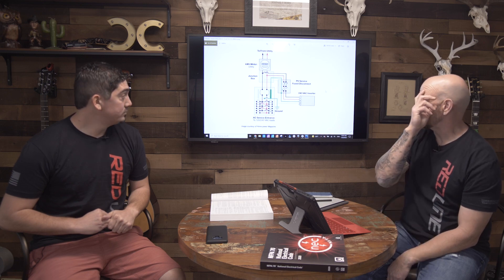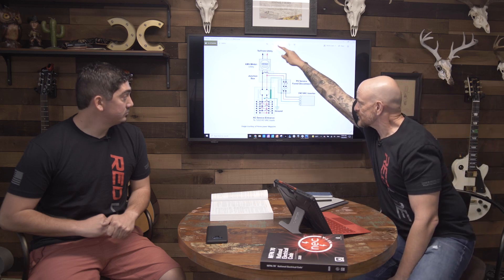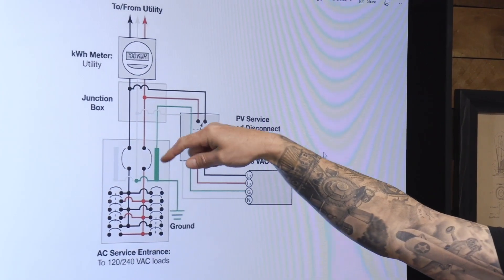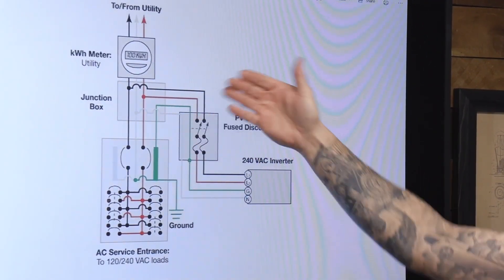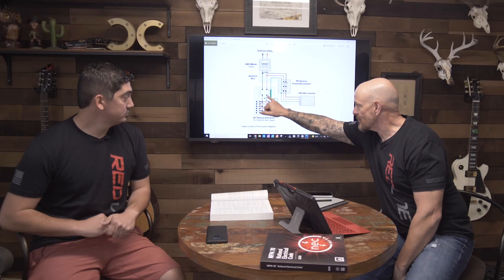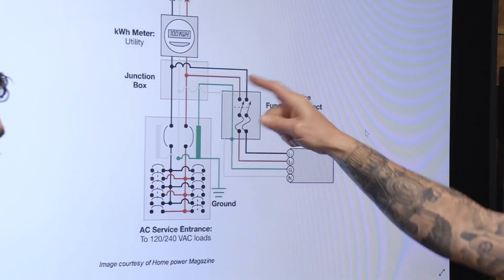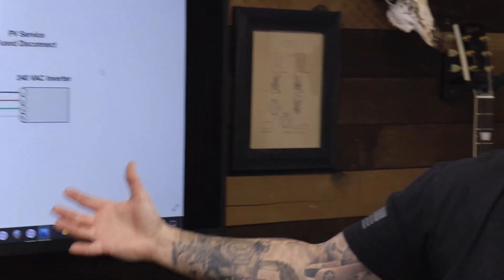There are different codes you have to abide by when you do that. The NEC tells us exactly what we have to do regarding ratings, gauge, and protection devices. You can't take 200 amps of solar and have 200 amps of power coming in without a protection device, because that's potentially 200 amps coming one way and 200 amps coming the other. If it's 200-amp rated, there's a potential for going over that rating and then you have issues. You'd have to put in a main breaker, because the reason we're going around the panel is we need something more than what the panel allows.